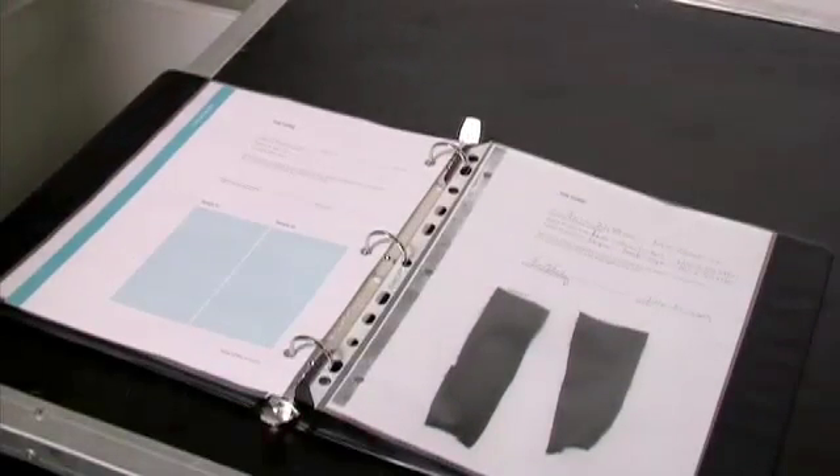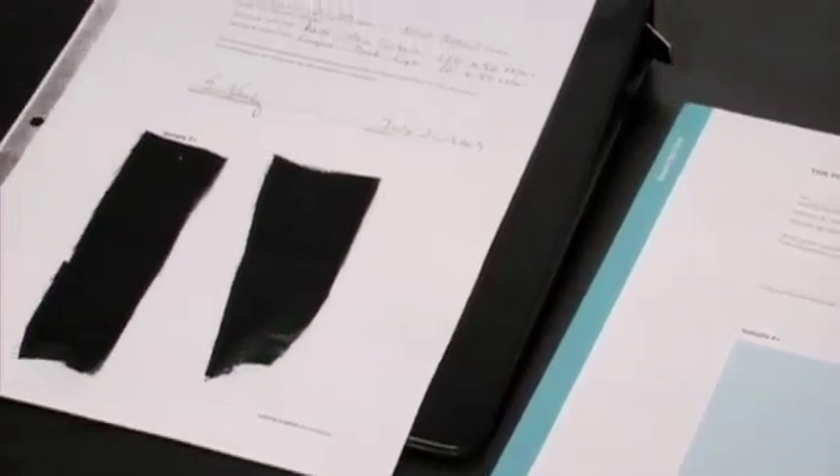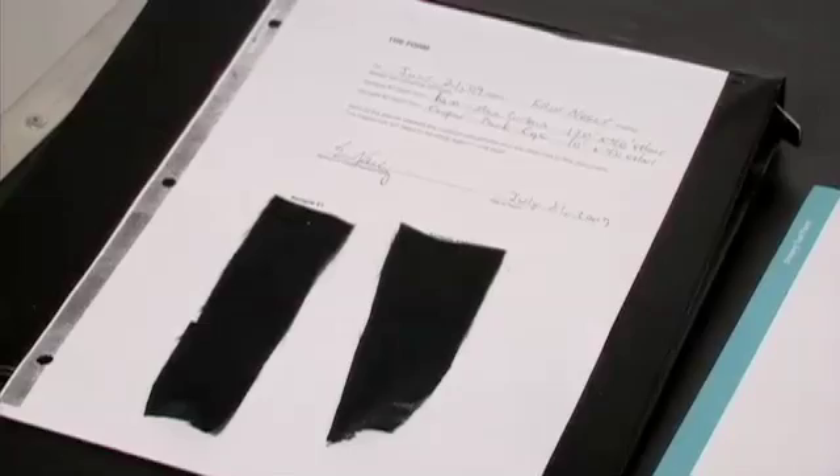We recommend that a theatre or a company that has soft goods for display maintain a log of all their goods and a record of whether they're flame retarded or inherently flame retarded, and that each year they should perform a test on the materials to make sure that the treatment is still valid. Nowadays manufacturers are moving more towards inherently flame retarded materials so that retreatment won't be required. Awareness and availability of training videos and resources through the internet is making it easier for people to comply.